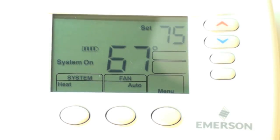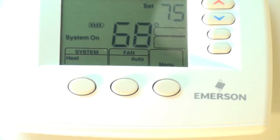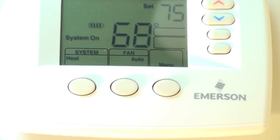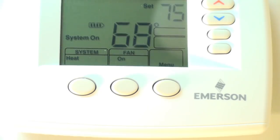Now I may be wondering: do I have power to the furnace? There's a quick and easy way to find out if you have a fan switch on your thermostat. I'm gonna find out if this furnace has power to it. It says auto where the fan is — it's in the automatic position, which means it comes on when the equipment comes on. There's another position I can put it to: on. If I put it to on, it's just gonna be on all the time. And if the fan does come on, then I know I've got power to the furnace. Now if the fan doesn't come on, we've got another issue.